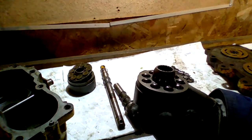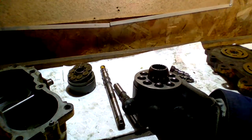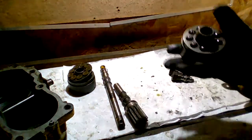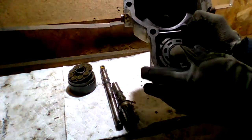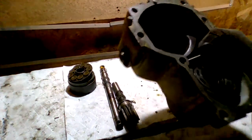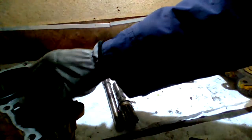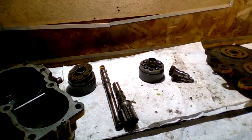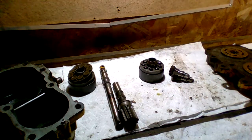Unfortunately, I don't have all the carnage, but it left a bunch of little pieces of brass and junk laying around in there. That, of course, spins in this case on the other end. And that spins on a fixed swash plate. It does not pivot, unlike the other one. And that makes sure it always rotates correctly — forward actually goes forward and reverse actually goes reverse.